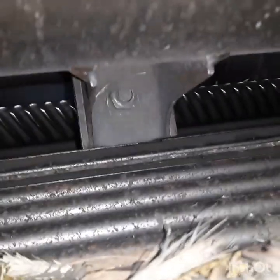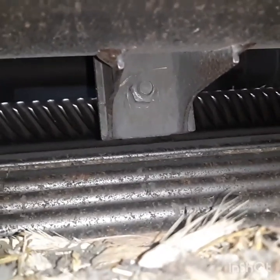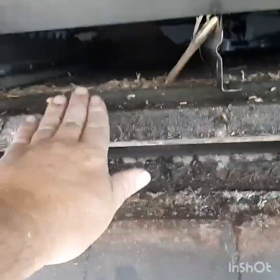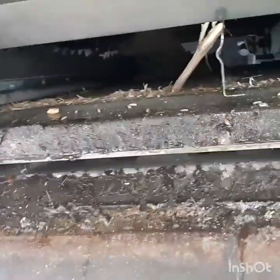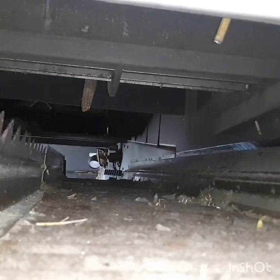Let me climb down and we'll go look underneath, because there are concaves for this APS system as well as a normal concave. So we're under the feeder house. Going up to the bottom side of the APS — there you can see it. I've got the wire corn pre-concave in and you can see the rasp bars right behind it. On this particular combine it's an old-fashioned key stock concave, just like in my John Deere 8820. With the round bar, here's the start of clean grain. We have a prep pan, not augers — it eliminates a lot of bearings and another drive system, but also improves grain quality.